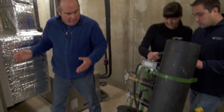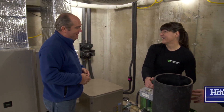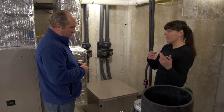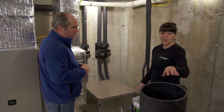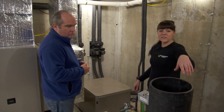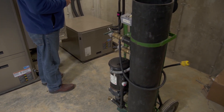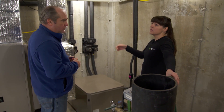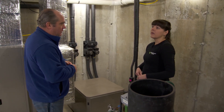We've got ductwork done, we've got all the pipes connected - but this system isn't going to work unless there's antifreeze in the loop. The antifreeze is what moves the heat from the ground into the heat pump. We use a special cart that has a reservoir - we pour the antifreeze in and then use pumps on the wall to introduce it into the pipes, trying to flush all the air out and replace it with glycol. The air comes out, antifreeze goes in.